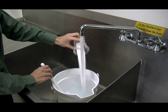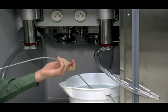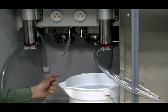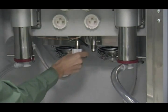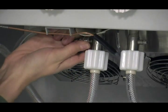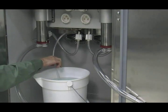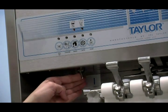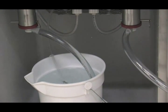Sanitizing: prepare a pail of approved 100 ppm sanitizing solution using warm water and following the manufacturer's specifications. Place the pail of sanitizing solution inside the mix cabinet. Brush clean the mix inlet tube with the long brush and sanitizing solution. Connect the free end of the flare line to the threaded fitting on the mix inlet tube. Attach the quick disconnect fitting of the pressure line to the other fitting on the mix inlet tube just above the flare line. Insert the free end of the suction line and pressure line into the pail of sanitizing solution. Place the power switch in the on position and press the pump key. A light will come on indicating the air mix pump is operating, causing the sanitizing solution to be pumped through the air mix pump and out through the pressure line.